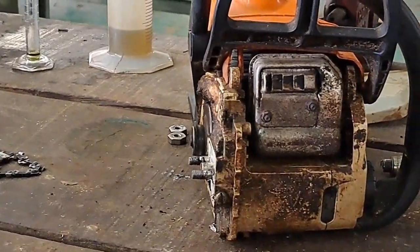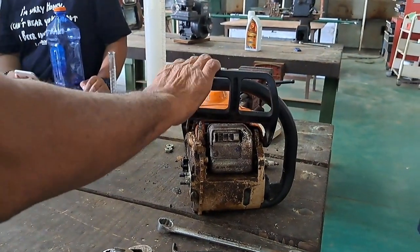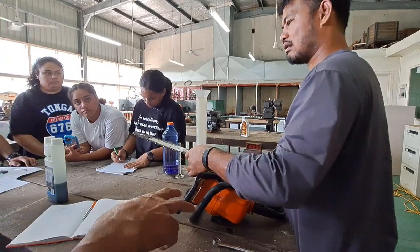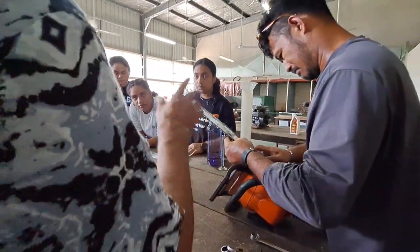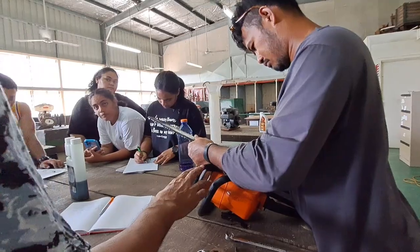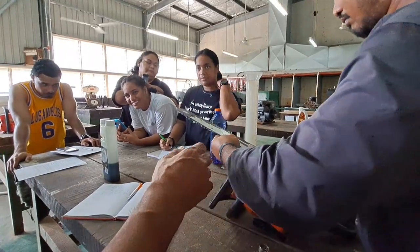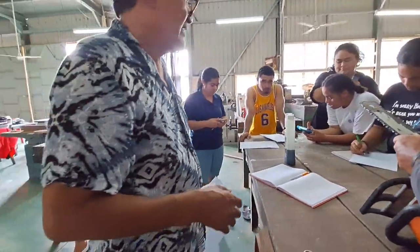The other things like checking the spark plug, etc., you should also do for this engine, like we did for the other one. The most suitable evidence for number two — to prove that this is a two-stroke engine — is the fact that the oil and petrol are mixed together. There is an oil tank here, but it's for the blade, not the engine. So don't say it has no oil tank; say that the petrol is mixed together with the oil for the engine.